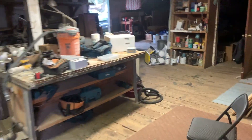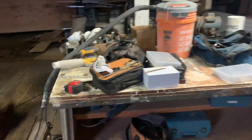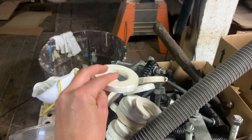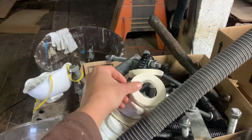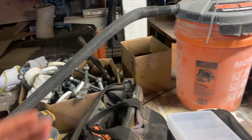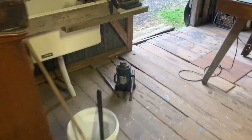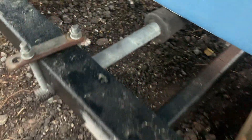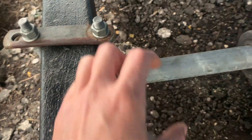We're putting some washers in between there that we just made today. We made a bunch of washers that will fit in between the area so that if the roller does slide this way or that way and hits the bolt, it won't stop it from rolling — it'll have the washer and it'll still be able to roll.